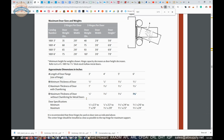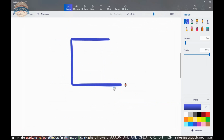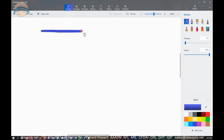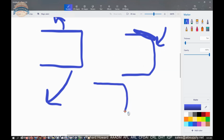I believe the word chamfer, the way I understand it, means if you have a door edge and you were to chamfer it, you would take a V-groove router bit and chamfer over the door. What I think they mean is, without radiusing, you can install this as a square edge door on the strike style. It always has to be square edge on the hinge style. Or you can install this as a radius door. I think they're terming chamfering with radius. Breaking the edge is what I understand chamfer to mean. To radius the door, you're going to do a large radius.